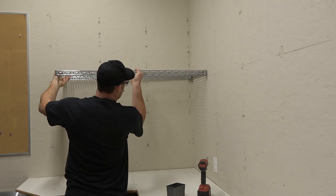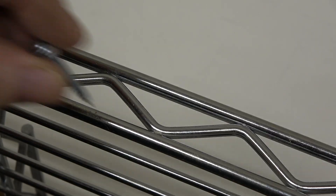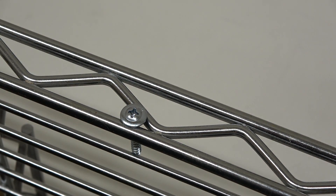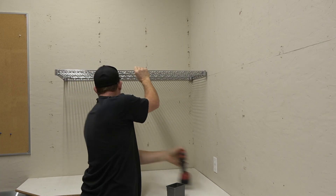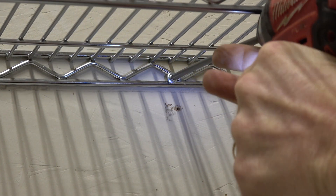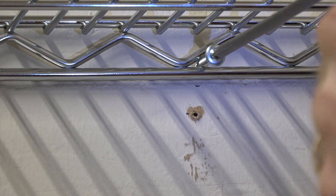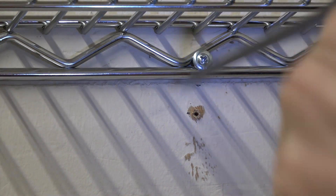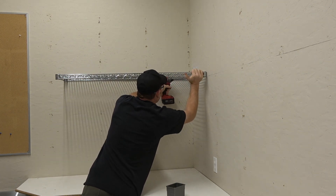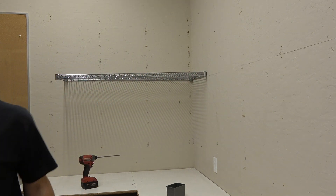I typically start by installing a shelf level. In this case I have some plywood on the walls and there's a wood seam that I'm using as a guide. I use these screws because they have a big pan head and they can go between the gussets of the wire. Because I have plywood on my wall I can put screws pretty much anywhere I'd like. I usually try to hit the studs when I can but then I place the screws wherever else I'd like. These particular screws are designed for brackets in home construction so they have a little bit more strength, and I prefer to use something like that for an application where you're bearing weight.